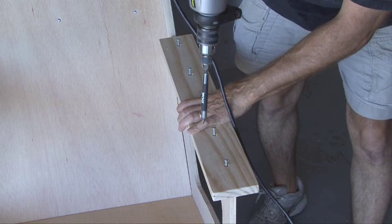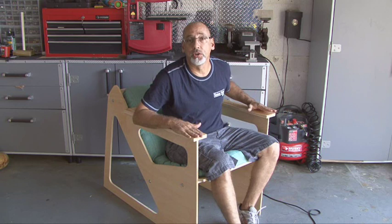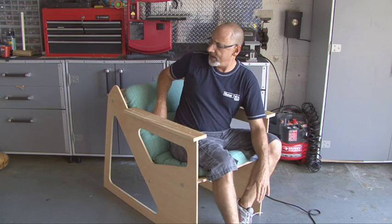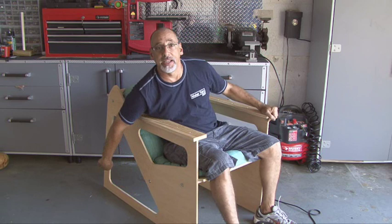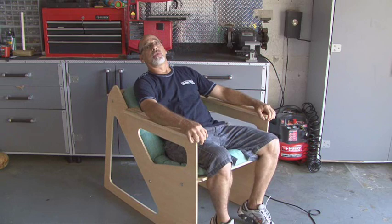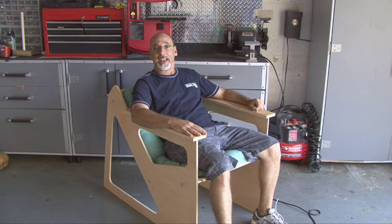My Rockback Chair is finished. I've covered it with 3 coats of polyurethane spray, lightly sanding in between each coat. For the cushion, I found a 22x40 cushion at my local home improvement store — the perfect size to fit the Rockback Chair. Now, I opted for the standard version. To actually make it rock back, you would not make this large cutout at the very beginning, and then you would make an angled cut at the back which would allow the chair to rock. I don't trust myself doing that, so I opted for the stable version. And I tell you what, it's pretty comfy. That's how to make a very cool chair out of a single sheet of plywood — the Rockback Chair. We'll see you next time with another Weekend Project.